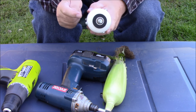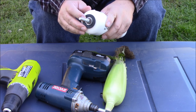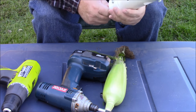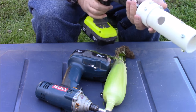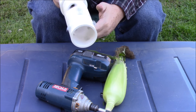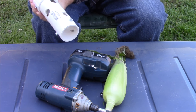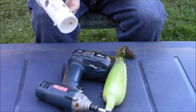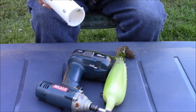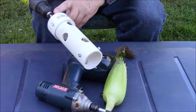Slide it down through the hole that you're going to drill in the two-inch PVC pipe cap. Then put a rubber washer on, a couple of washers, and the nut — snug it up. You don't want to snug it all the way; you want a little bit of play for the simple reason that this will self-center it for you. Kind of run it slow and watch it — what you're looking for is no wobble. If you get a little bit of wobble, adjust it with your hand a little bit. Play around snugging it back and forth so it'll hold its shape, then spin it again until there's no wobble. Once there's no wobble, very carefully tighten that up and it'll stay centered — that is why I didn't want to take this particular one out.